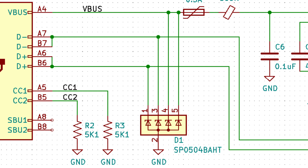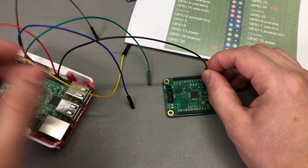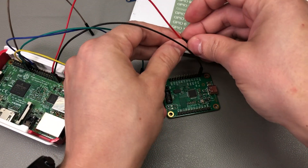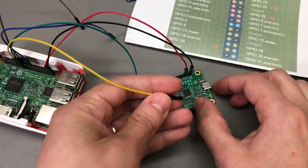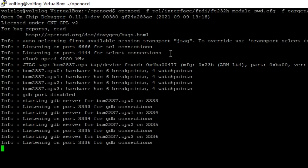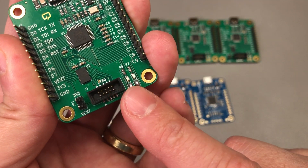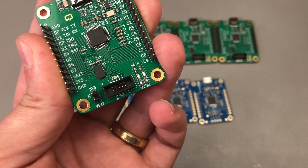That was issue number 1, but there's more. With the diodes removed, USB was functional and I proceeded with further testing. I connected the pin header IOs labeled JTAG to a Raspberry Pi — it was on my desk and I knew it had a JTAG interface, so it made a good test target. After messing with OpenOCD for a good hour to get the configuration right, I successfully had OpenOCD connect via JTAG to the processor on the Raspberry Pi. The next thing I tried was connecting via the special JTAG port that goes through the voltage level translator — but it was not connecting.